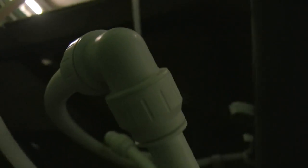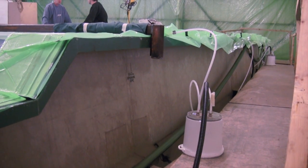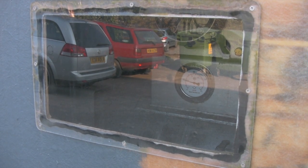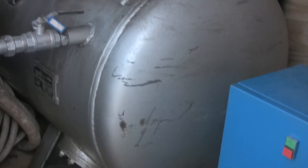Around the outside of the mould tool is the active vacuum that's sealing all our flange boards and mould joints. That's run by one system. Then we have another system which runs on a series of catchpots. Catchpots then lead to a perimeter vacuum. The twin pump 900 litre expansion tank feeds both the active vacuum and the perimeter vacuum.